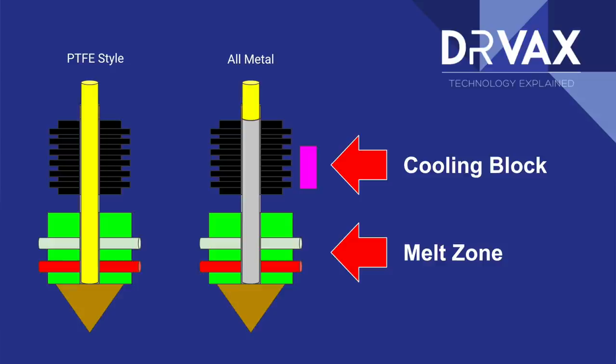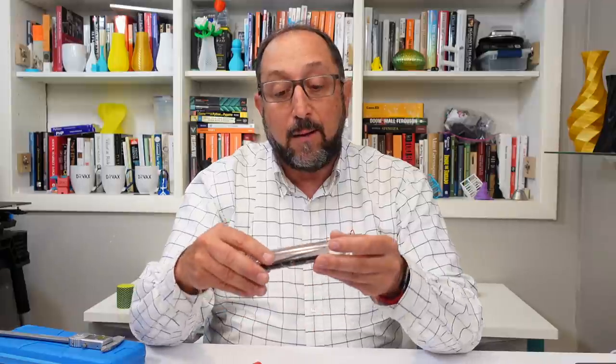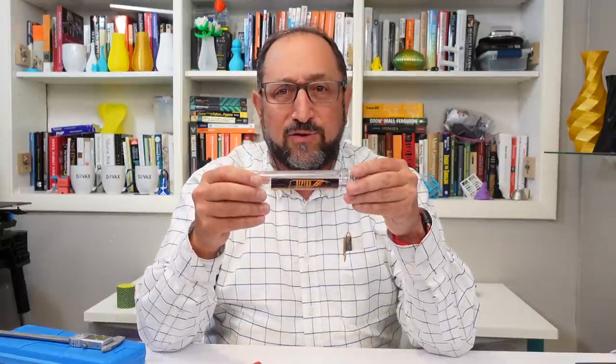Item number seven: these are little needles that you use to clean out a nozzle. The best way to clean out the nozzle on a 3D printer, particularly if you have a Bowden system, is to pull the Bowden tube out of the hot end and then, with the hot end heated up but the power off, push this pin through. These little wires are available in different sizes for different size nozzles. This kit from Reptor is the one I like the most, but there are many different varieties available online.